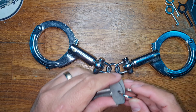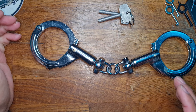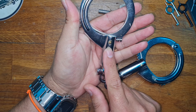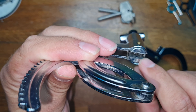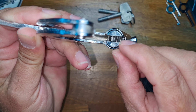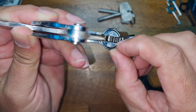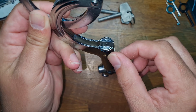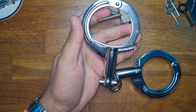I have said in the past that there is no bypass available for this. Well now ladies and gentlemen, I am pleased to announce there is a bypass — for the single lock only. We're going to reach down behind: there's a very, very miniature gap just behind the ratchet wheel. We're going to take advantage of that gap. It is around about 0.2 millimetres — it is minuscule. But as they say, 0.2 — why not?